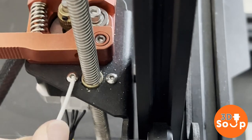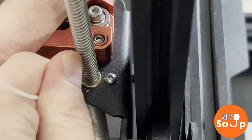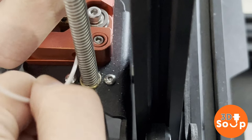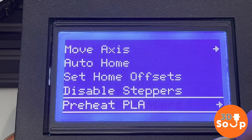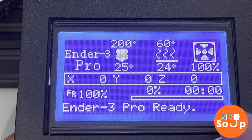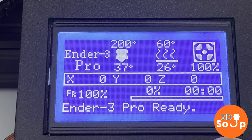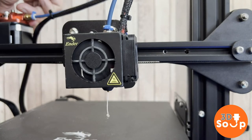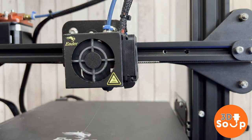Now just put the filament back in. I've cut it at a 45-degree angle so it's got a nice point to it and should go straight in without a problem. There we go, down the Bowden tube until you feel resistance when it reaches the hot end — I've left mine cold so it should stop just when it reaches it. Now let's heat up the PLA — there we go, it's got to 200 degrees. Then we can thread the filament through and get this thing started. Pinch the extruder, give it a push, and there we go — filament's going through nicely, nice and smooth, not getting stuck anywhere down the tube. Perfect.